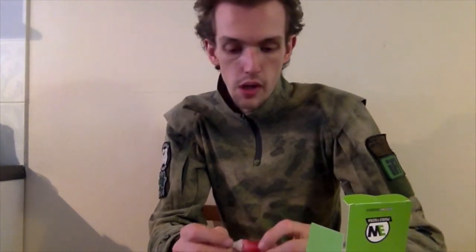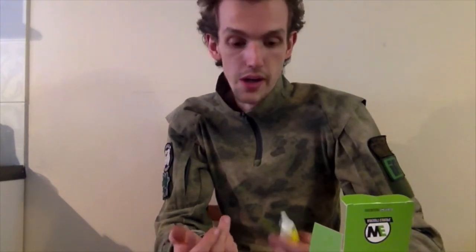Some things to note: a lot of this stuff can be bought a hell of a lot cheaper elsewhere. It's convenient to have them in these little bottles. The silicone is approximately 75 weight — that's the closest approximation I can get comparing it to the various types I have. The PTFE grease is basically standard 3-in-1 grease you can pick up from a motor parts store. The anti-friction plastic lubricant? That's literally just spray silicone grease — they're just labelling it by its use case.